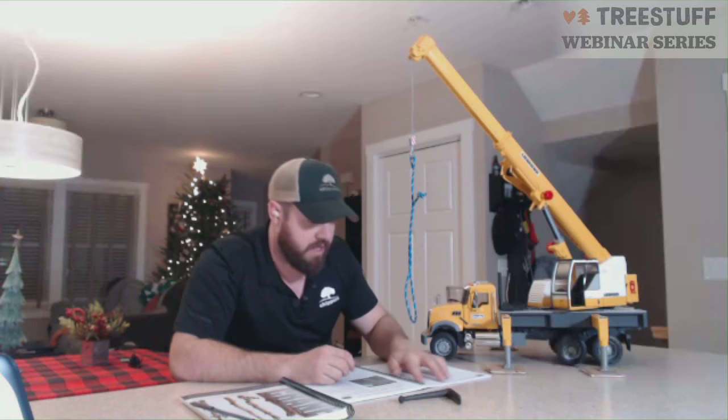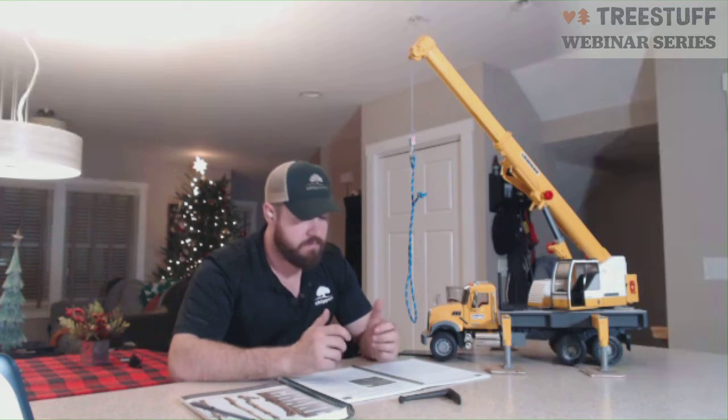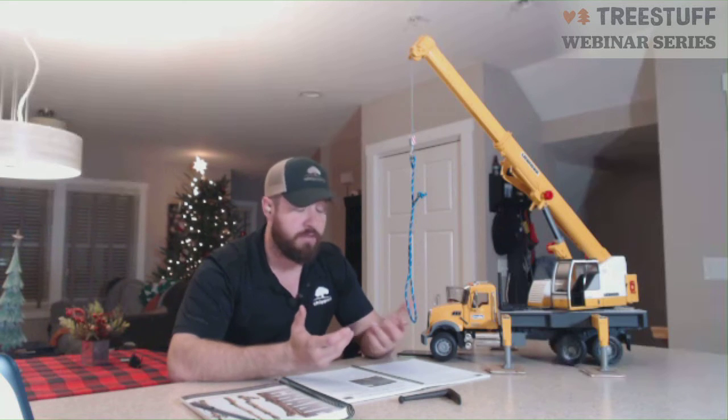Soft shackles, in my opinion, have the ability to work very well for our industry if used correctly and monitored regularly. Again, they've been utilized in the towing and recovery industry for a long time. You're not using the soft shackle for the primary lifting. You're using it for the binding of the lifting strap back to itself. Again, it's a great product that when used correctly and when inspected regularly has a long service life, but there is some inherent problems with them.